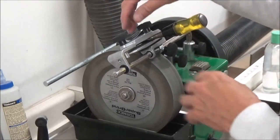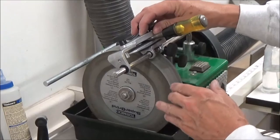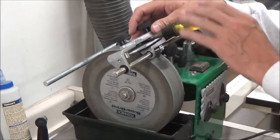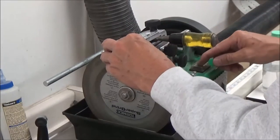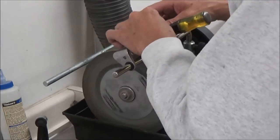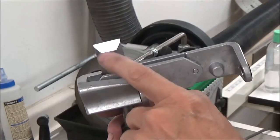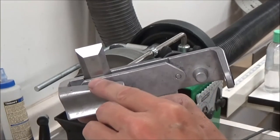I've loaded the chisel in my tool holder. I've noticed this chisel is getting very short and this part of the jig is very close to the wheel, so it's getting near the end of its life — but I still got some material left. I'm going to grind this, just moving it back and forth across the stone using the whole width. That took me the better part of a Rod Stewart song, but you can see it's much better — it's squared up.